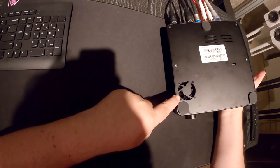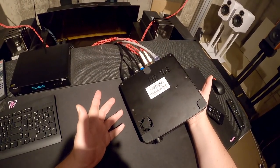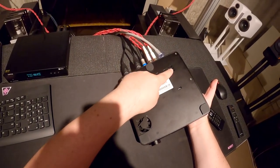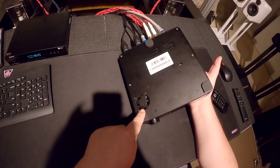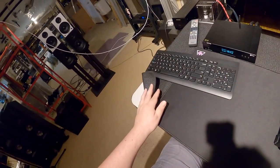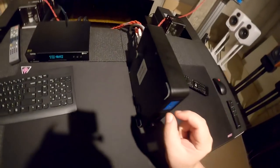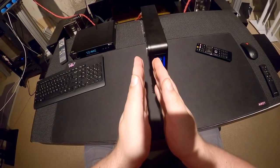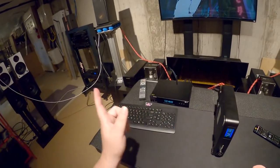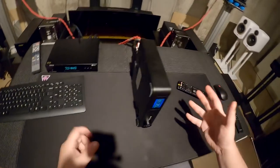That was when I knew something was up, because that is an abnormal feature for any small form factor amplifier. The feet are just rubber things, so if you have a soft desk you've got to watch out — I use yoga mat at my desks. If you have only about 4mm feet and you put it on a soft desk it's going to sink down and block that air vent — bad news bears. So this is expensive and it's hot.